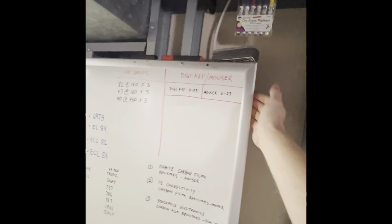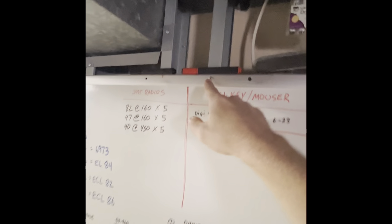We'd use a six-inch round connecting here — you can take this board off, it's just got two screws holding it on. Pan the back side of this up, connect here, and connect into our return piece. That would put us in the finished space on the other side. For combustion air grills, either going here on that side or near the stairwell — high on one, low on the other, going back or up front.